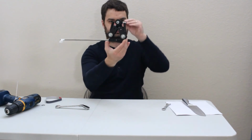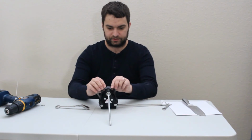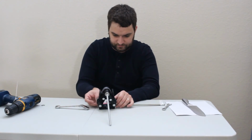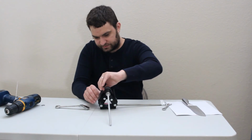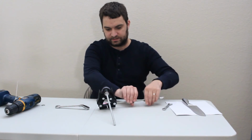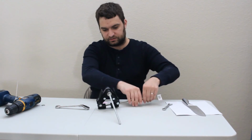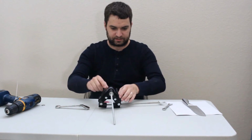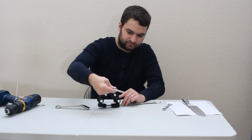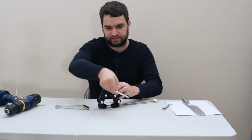Now to put on the belt, just kind of screw this out enough that you can put it all the way back together like that. Put your belt over your 3 pulleys and in these grooves in the angle guide so that it's nice and triangular and against the plastic, and just kind of tighten this. Don't over tighten it, because if you over tighten it, you're going to have all the pulleys sort of trying to bend in. What you want is just enough that it's sticking to all the pulleys and that the drill is going to move the belt, not just slide pulleys under it. So just enough that it's still easy to turn, but you can see the belt turning.